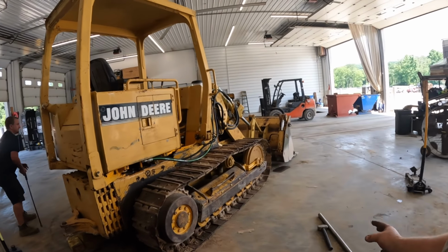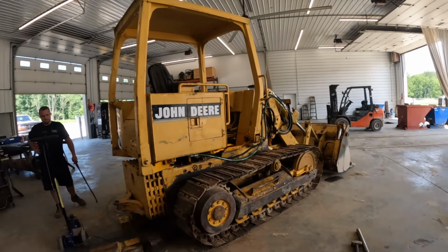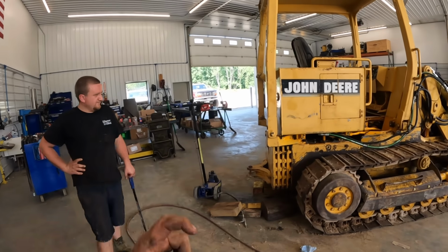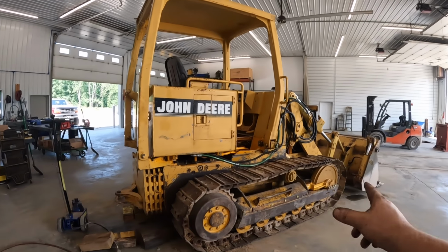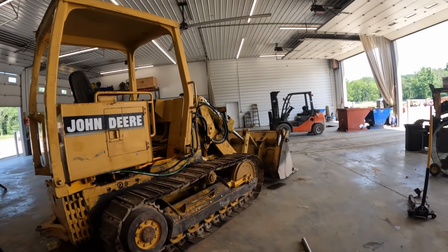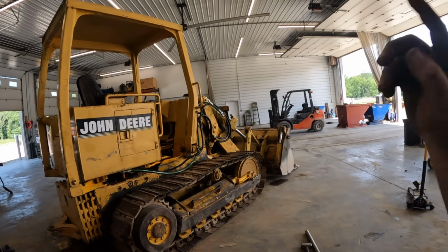All the bolts, what we have, 4 holes and they had broken bolts, surprisingly. The rest are just full of dirt. It's like they used too short of a bolt before. That track frame was actually sprung a little bit out, so we had to crank it in with some C-clamps. You guys seen it on the time lapse.